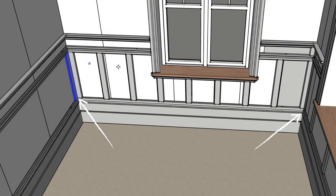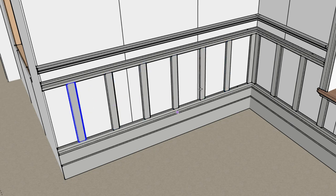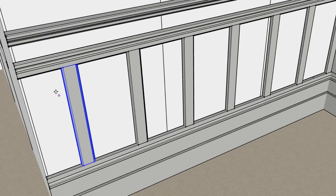Choose a wall where you can get your measurements edge to edge. The size can be between 25 to 35 cm per compartment, preferably around 30 cm or 1 ft. This wall has a different measurement, so I won't be able to keep 30 cm between the compartments, but it doesn't matter — you can go about 4 cm in each direction without it showing. As a carpenter, you do quite a lot of math and there are tricks and formulas for almost everything.